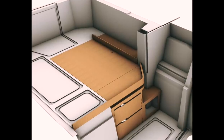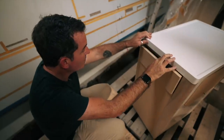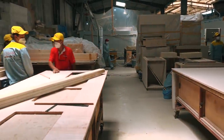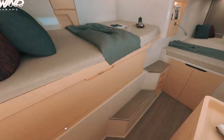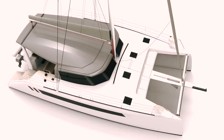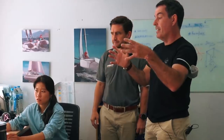Miriam has designed all the woodwork with the team, which then goes to the carpenters. We go from concept — something that looks great — and then back it up with how we actually make it. That's what Miriam's been working through with her team: getting it to something we can construct. In conjunction with our fit-out team's years of practical building experience, we then make minor adjustments to make it viable as a production item in terms of weight. Miriam runs a continuous weight study file covering all aspects of the boat.